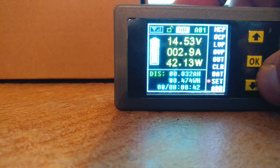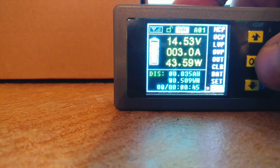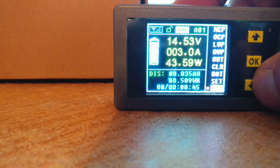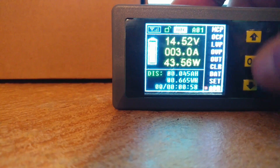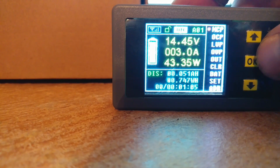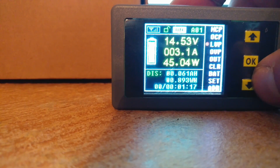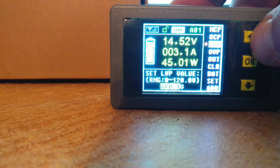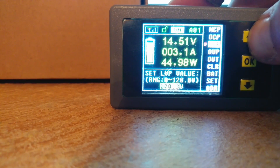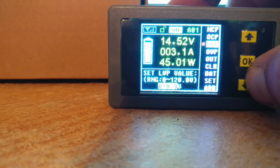You can have the display turn on and off after a set time. ADR is the wireless address - you can set the wireless channel if you're running more than one unit. There's also over-current protection and no-current protection settings. NCP is no-current protection, OCP is over-current protection, so you can use the relay to trigger a shutoff. Low voltage protection lets you say: if the battery gets to a certain voltage, turn it off to prevent further discharge.